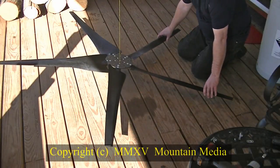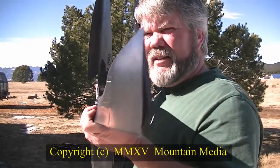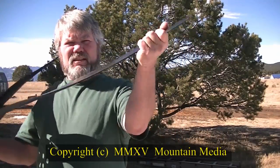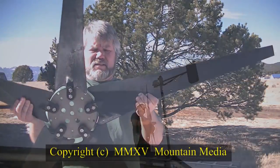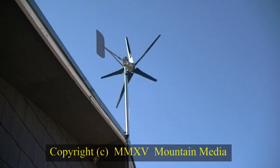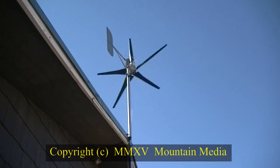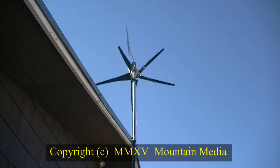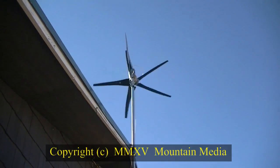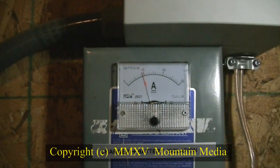When I received the blades, I installed them on the hub and checked them for balance. The blades are more meaty and seem to be in a whole new class — having sturdy construction, while still flexible enough to bend a bit in the wind. The diameter of the blades is also larger. Then I went up on my roof and installed the new blades and hub, and waited for the wind. With these newer blades, my system is now producing 10 amps steady at 58 volts DC, and those 20 mph gusts produce 15 amps, or 870 watts. That's not bad at all.